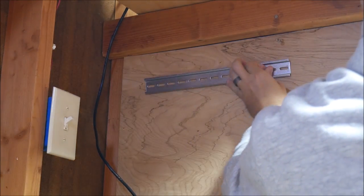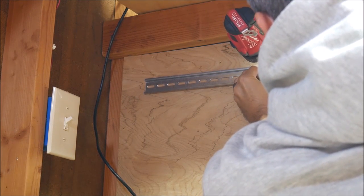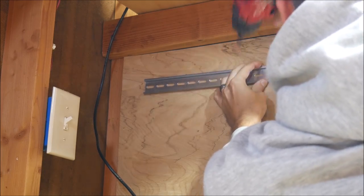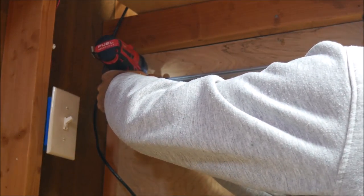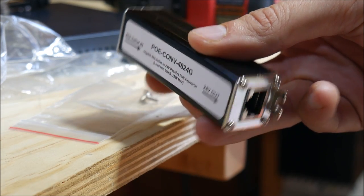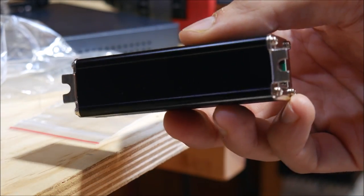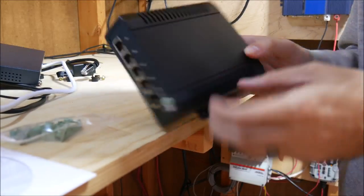Back to the Tycon switch in my shed — let's get it installed. I could mount this switch directly to the plywood board, but I wanted to highlight that it can be installed on a DIN rail too, making it a great choice for use inside enclosures. It lets you pop it on and off easily without any tools, or slide it aside to access other components in a cramped box. Because I have a passive PoE device in my shed, I'm going to use a converter here to convert 802.3af to 24-volt passive PoE — but this won't be necessary for most installations.